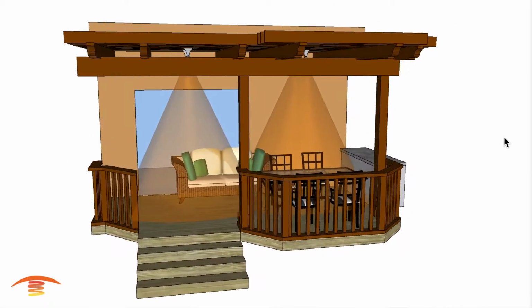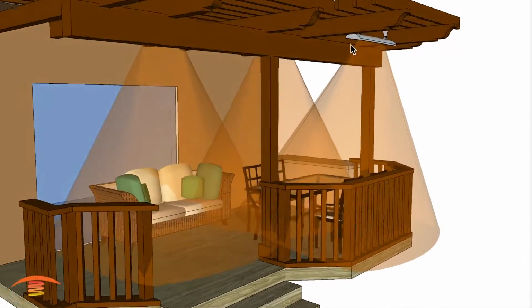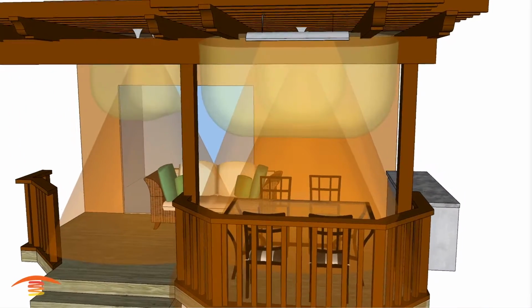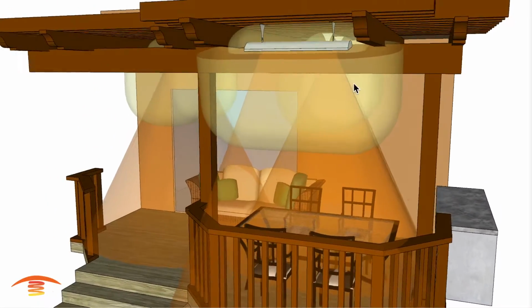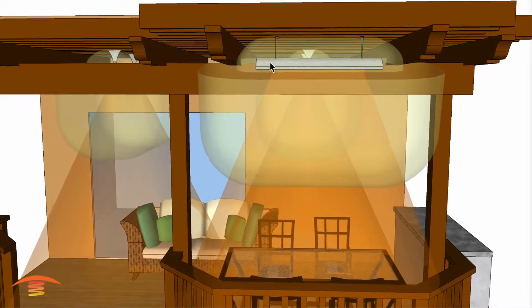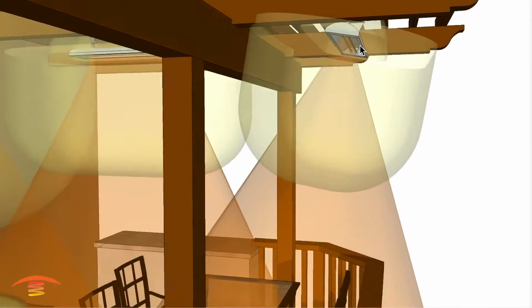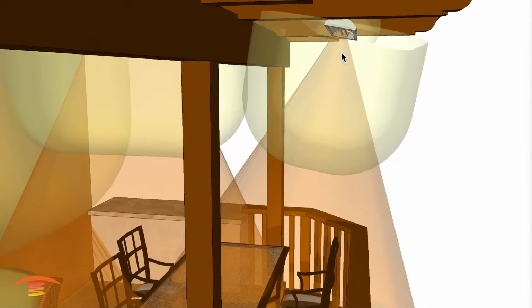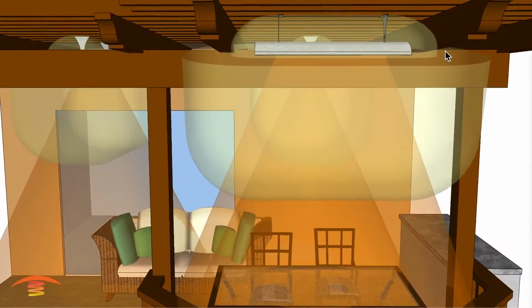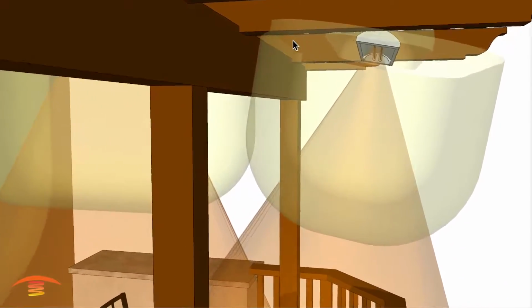All right, so the next option would be to add an additional unit. Sorry about that. Adding an additional unit, I got the same 4,000 watt unit here, and again we have those clearances above and below. So here's the clearances above. You can see that with that distance, I think it was 4 feet 4 inches, there's no issue with regards to that. And then I do have this at a 10-degree tilt. Now we're just capturing some of this edge here and over here. I'm not quite sure if that would be permittable or not, but I think it'd be okay.